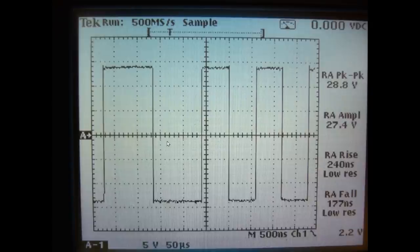Some of the things that can happen due to electrical noise on the rails and inductance — the interaction between the wires and the DCC signal — include these edges being rounded off. After a while, if you accumulate a lot of these, the decoder will begin to ignore some of these signals that make up your DCC commands, and that's when you lose control. Each major division here is 5 volts with 1-volt increments, so we're seeing about 14.4 volts — right about what you'd expect. This is a very clean DCC waveform right out of the command station.